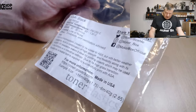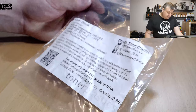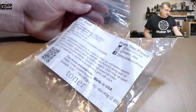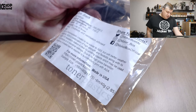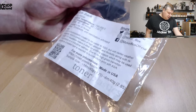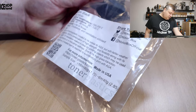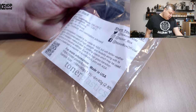I was having about 10% or 20% fan for one of my prints on this one. They say enclosure and ventilation is advised. Similar to ABS, you want a pretty stable temperature during printing, but here they say ASA is a thermoplastic created to be similar to ABS but with better weather resistance.